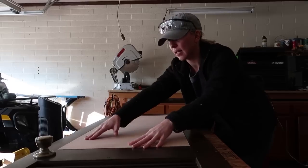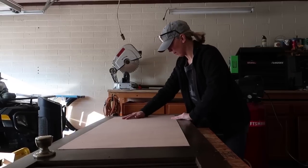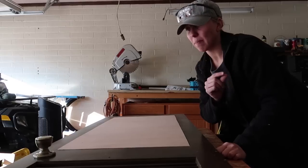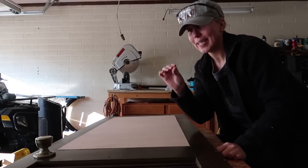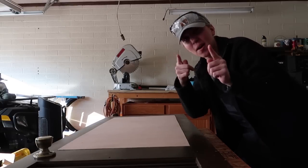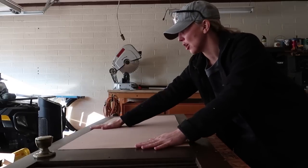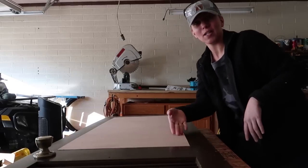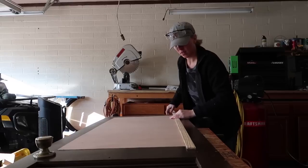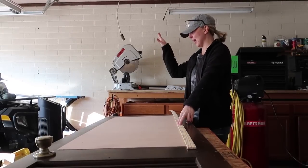The cardboard squishes just a little bit, so when I put the nailer on, I can't push down on it — that's what we want. Then when we put the trim on and do caulking, I won't have a big struggle. See, that is perfect — no spots where I can press down and the board flexes. The lip is so small, so the room for error is near none. We're beginners and we're just making it happen and having fun. I'm just pin-nailing this in and the trim will cover it. Let me show you the trim — I just got lattice trim, and see, this covers that gap. I love it already — it's already so much better!